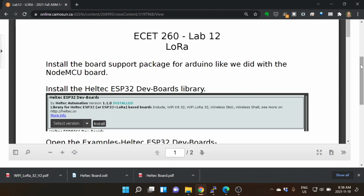If you have a Node MCU or you have one of these around and you don't have an FTDI unit around, you just put the processor in reset and then use the USB to serial interface. The FTDI we've talked about quite a long time ago, and it's got really good drivers, and that's what made it really popular. There are Cypress CP2102s generally in the ones that we come up with, like Node MCUs. So any of those can be used.